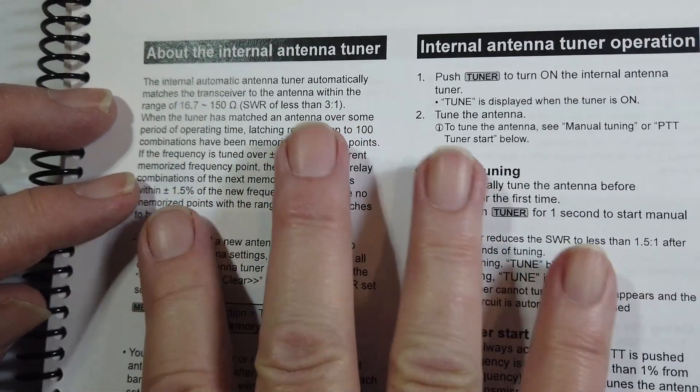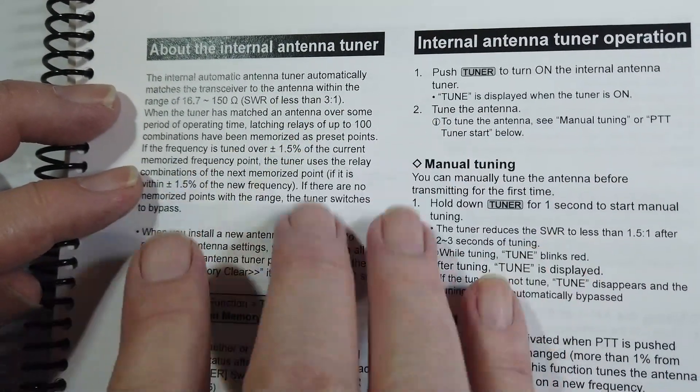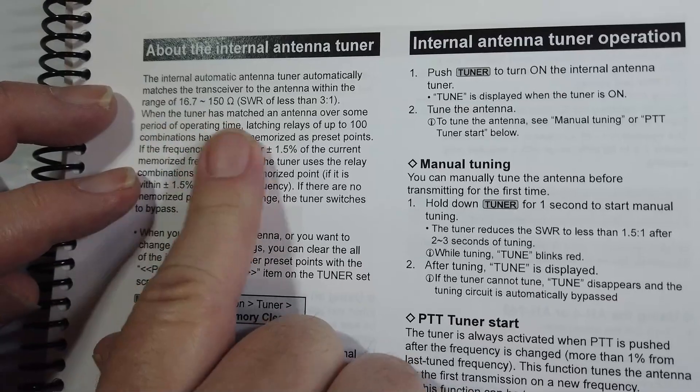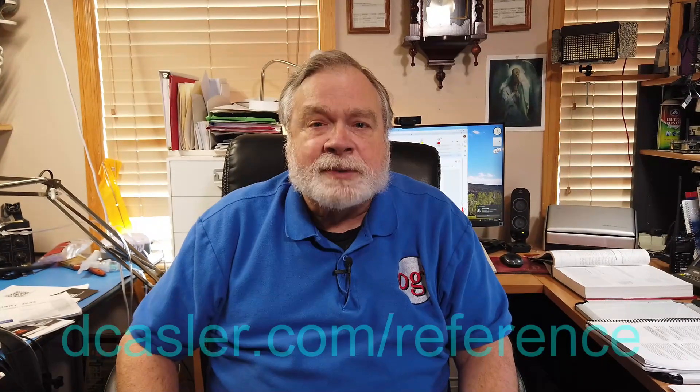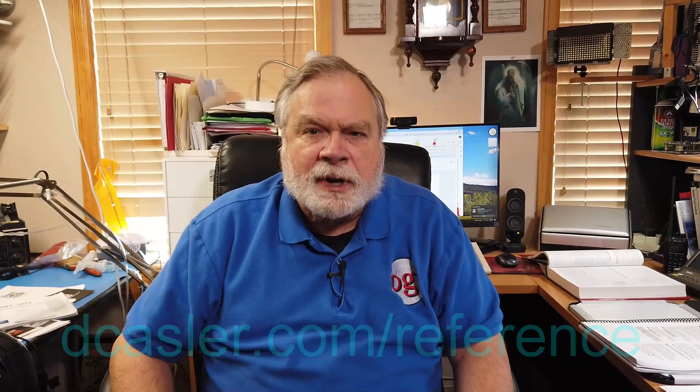So what he's saying is that it will tune outside its specs. I have no way of creating artificial loads other than my 50 ohm load, so I can't really test how far out this can go — I need to create such a load. But in the meantime, the point being that the specification for the radio, the ICOM 7300 — which is the reference station radio, as you can see at dkastler.com/reference, where I have a reference station all set up — the tuner will do probably a little bit better than that. The tuner may reach out to tune it and only be able to tune it to 1.5 to 1 SWR, and then it will let that go.